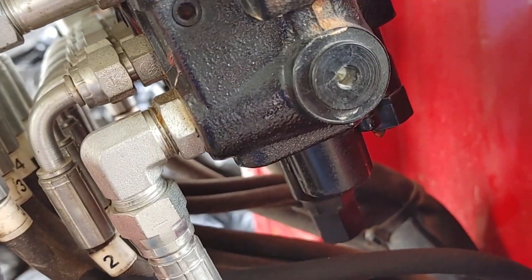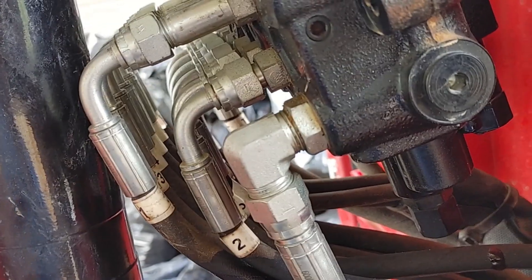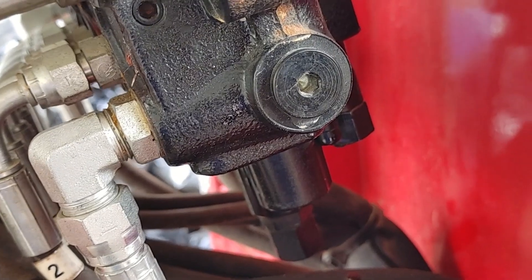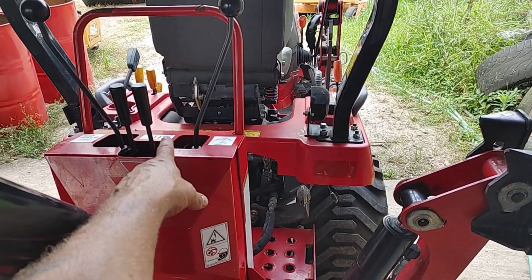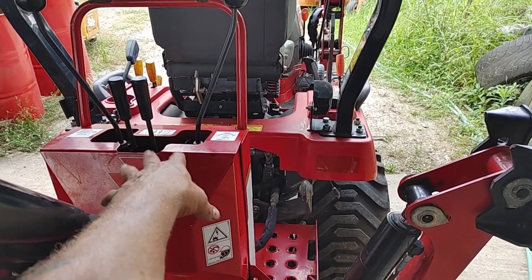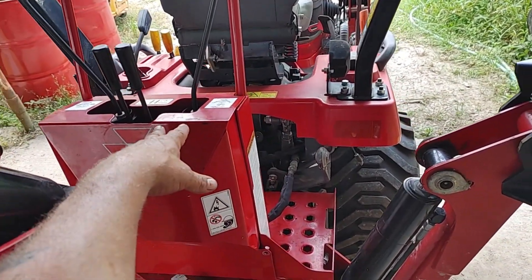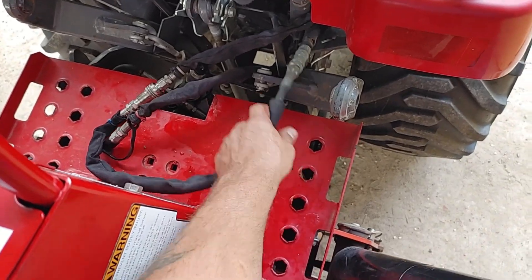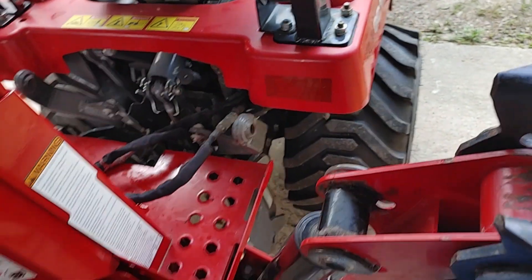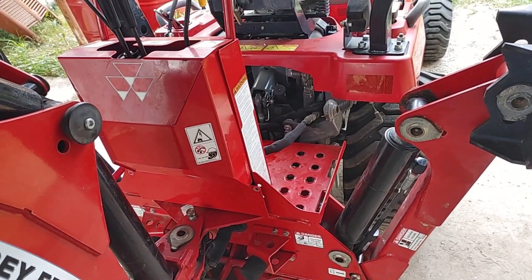I wrapped a rag all the way around that sucker in case it blew apart — one, I didn't want hydraulic fluid going everywhere, and two, I didn't want to lose any parts. Then barely easing the stick back — I mean gently, just enough to pick up — it did it. I got it bolted back up to the platform. I don't want that valve hanging on those lines, so I put all three half-inch bolts back in it, holding it to the housing, and threw the cover back on. I also bled it all down, disconnected my lines, and rerouted them so the tractor is separate from the backhoe. She is temporarily out of commission with the backhoe, but at least I can move it now.